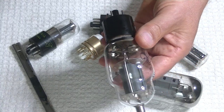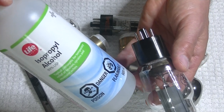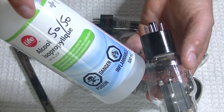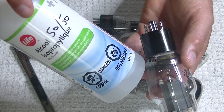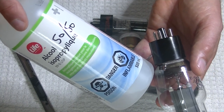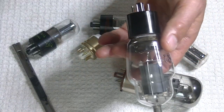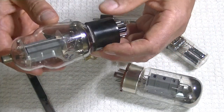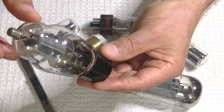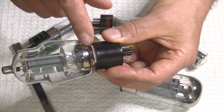I should show you my stuff — this is what I use, 99% pure alcohol. What I do is blend half the bottle down with filtered water, so I end up with a 50% alcohol, 50% water solution, then put a couple of drops of dish soap in. This is my general safe cleaner for tubes and around the tube lab. If you let the glue dry overnight standing on an angle, you'll get a blush, and the alcohol will take that blush off.